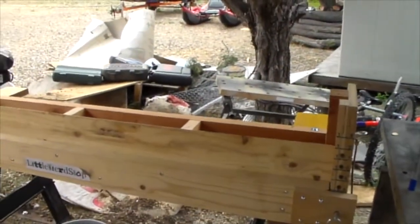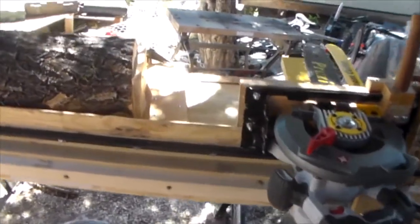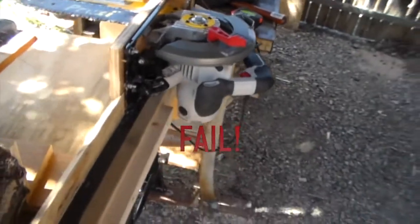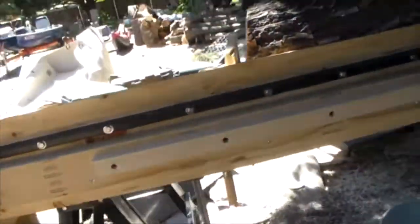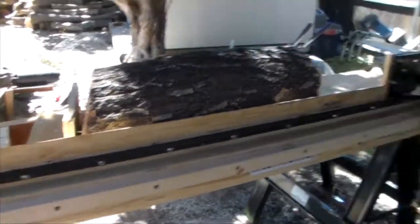So that's what's next. Well, the little plexiglass pieces did not work. Once I was making a cut, and once I get down low enough, this saw was hitting them. So I just popped them off, went ahead and stiffened it with the angle iron, as you can see there. See how that works? So I'm getting ready to make a cut. If that doesn't work, and this piece I put on here, you can see the saw case runs against it there too to support.